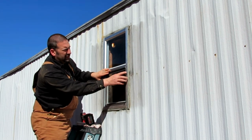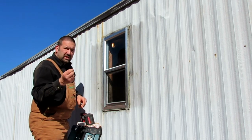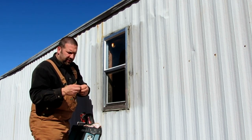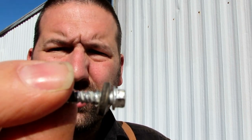Around the edge the screws go in the outside of it. I'm going to use a quarter-inch head — it's made for roofing, but a quarter-inch nut driver will fit that just fine. The screw has a little rubber washer on it, and on the back side a metal washer so the head of the screw doesn't smash the rubber out. It's a double washer, and it has a nice sharp tip so it can get into the metal and make its own hole.